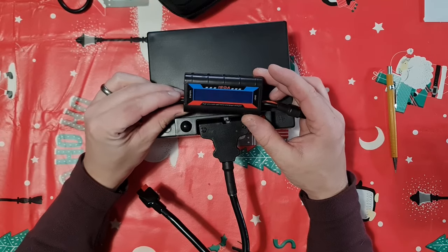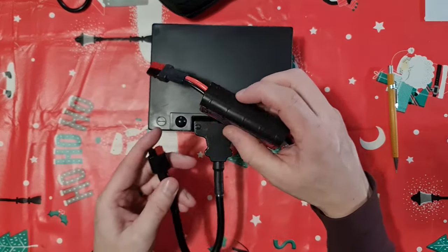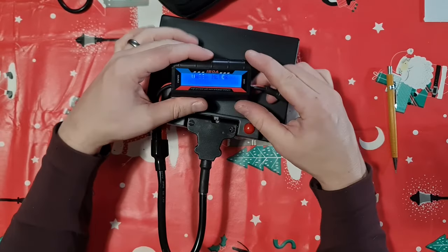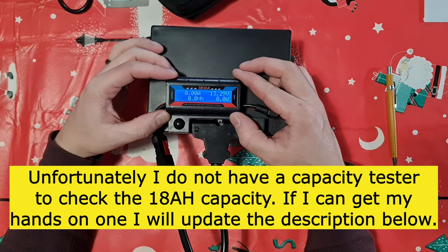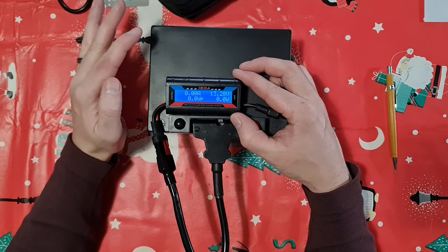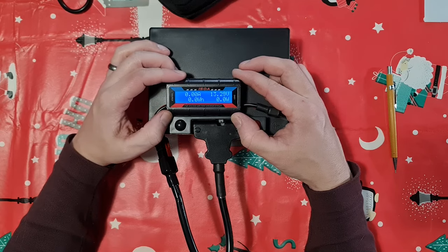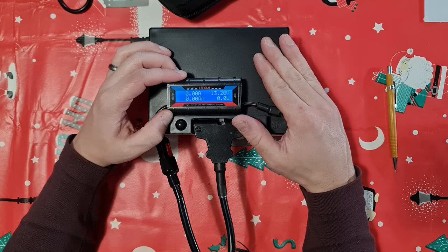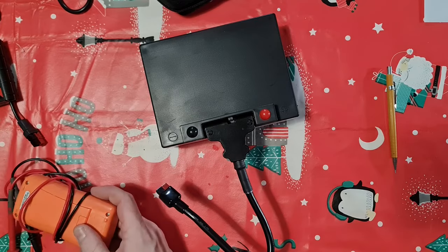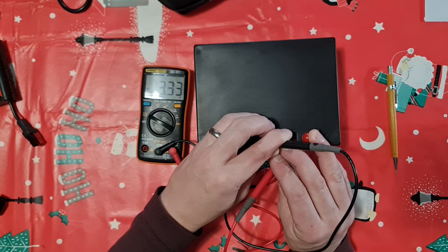I've got a little load meter here — not super accurate, but just to give you an idea; I've fitted power poles to it myself, it's a cheap meter from Amazon. Plugging in, we can see right away we're sitting at 13.29 volts after I've been using it for maybe half an hour. I also cross-checked with a multimeter and it reads pretty close to the same. This is absolutely ideal for ham radio — the radios are happier when the voltage is above 12 volts; that's when you get full power. And that stable voltage is one big benefit of lithium iron phosphate chemistry.